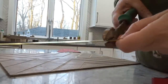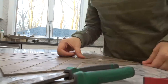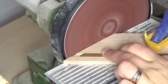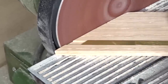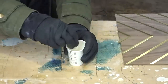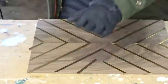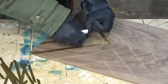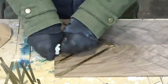I cut the brass strips using some rusty old shears I found in my garage from the previous house owners - it worked okay. I cut them to rough length to fit into the board, then put a jig on my benchtop sander to create a perfect 90-degree angle for the pieces to fit together. Here's where things started to go a little downhill - the biggest problem was that I did not put a deep enough groove in the board to accommodate for the thickness of the epoxy and the brass.